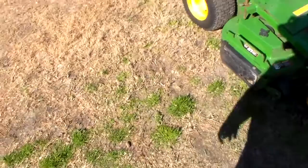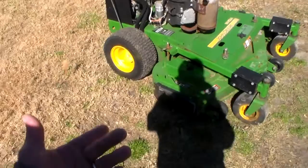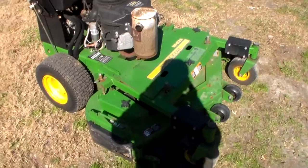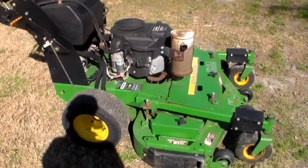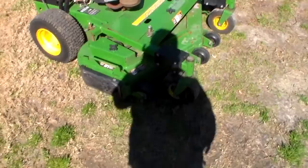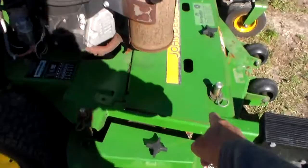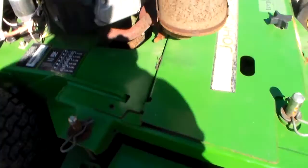This thing's just a monster. It's got the mulching plate on it, as you can see here — that's a John Deere plate. That's a nice deal, because with the deck being so wide and so powerful, it just shoots forever. So you really need a chute blocker or something. When I bought this machine it had that plate on it and I never took it off, and I never have a problem. Really thick stuff I might slow down a little bit, but this thing does a great job of just tearing it up and going right through it. The wheels are solid front, so you never need air for these wheels. You've got the weights on here so the deck's not bouncing around on you, anti-scalp wheels in the front, and two in the back. It's a floating deck, so it'll hit those anti-scalp wheels.